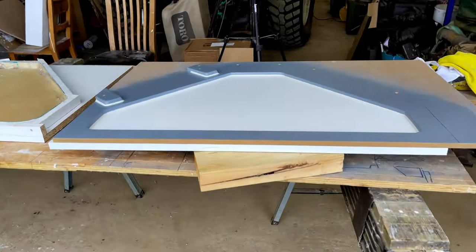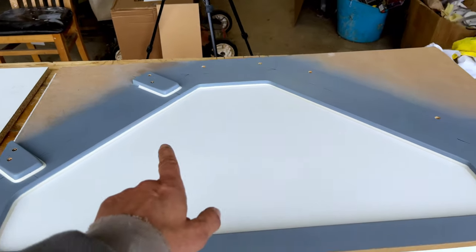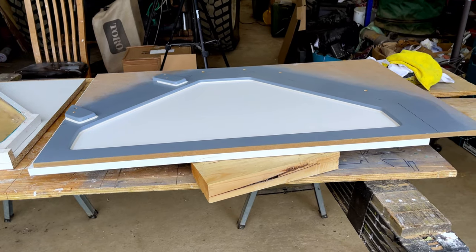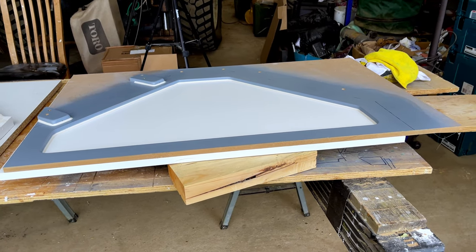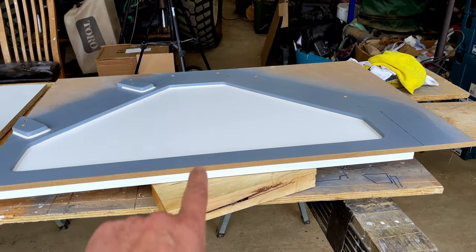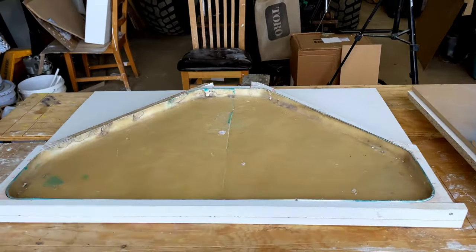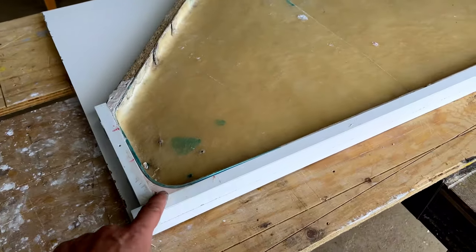Have a completed mould, certainly the bottom side anyway. So this is now all ready and Richard's just put down a layer of wax, so we'll need to put down another 7 layers and then we can send this off to our GRP specialist and they'll mould that part for us. And the top half, we just need to wait for the filler to set up overnight.